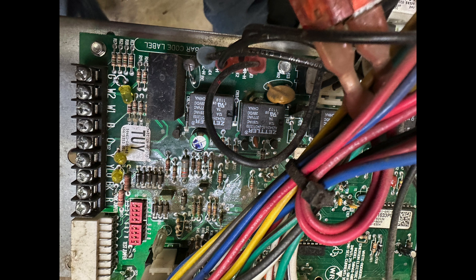What that means is, when you turn this thing on, the thermostat is going to call for heat, but it's not going to turn on the second stage right away. The board can tell the difference — if they're both connected up, W1 and W2 turn on at the same time, it delays W2 coming on for 10 to 12 minutes. And most of the time, that 10 or 12 minutes is enough to satisfy the load without ever going into second stage.